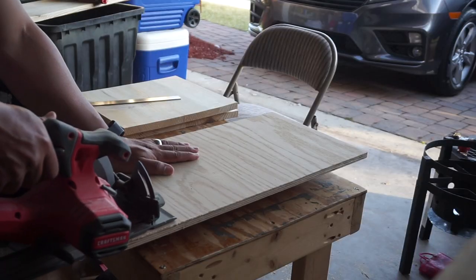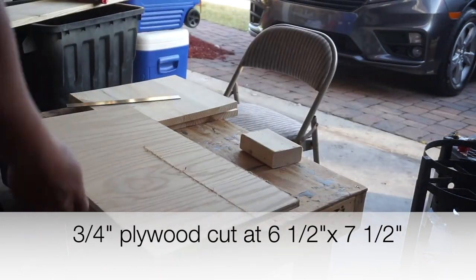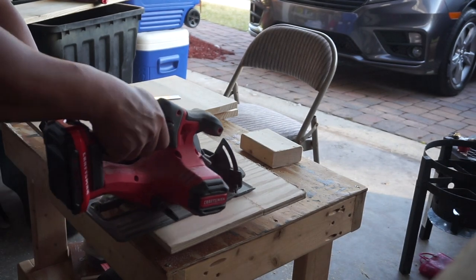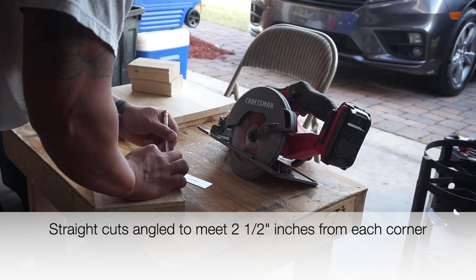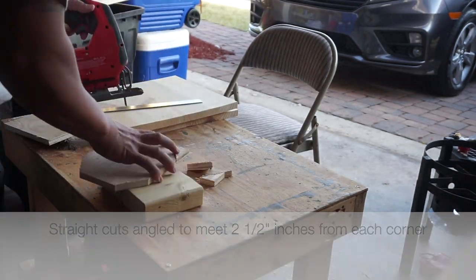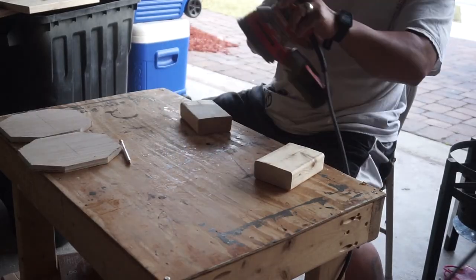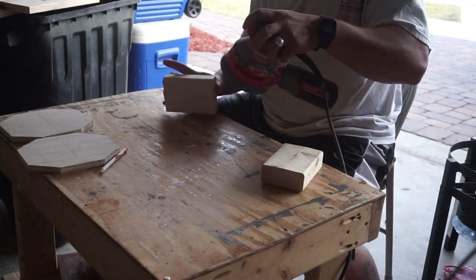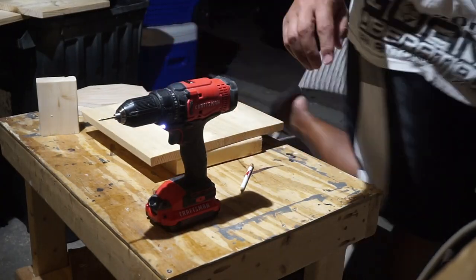One thing with pocket screws: drill them at high speed but put the screws in at lower speed so you don't destroy your wood. The plywood I'm cutting here is the top of the pedestal where the helmet's going to rest. I cut out a rectangle, measure out straight lines, and hit it with a jigsaw to make an octagon shape. Then give everything a rough sand — 80 grit initially, then 220 for a fine sand towards the end.